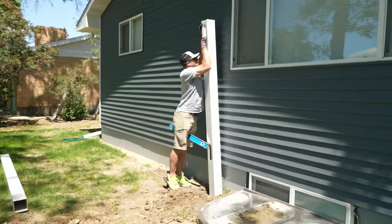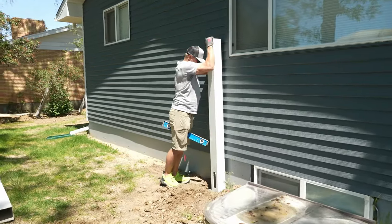Well, I would even say you could fill around the outside of the post. It's a little tougher because you put your post all the way to the bottom, then you fill around the outside. And sometimes when you put that concrete in there, it moves the post one way or another. It can be really hard, especially for beginners, to get that right. So the stab method is far and away the easiest. It takes a little more concrete to do that, but it's going to give you a really good product. It'll lock that post in there really well. That's where that extra bag comes into play.